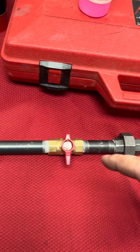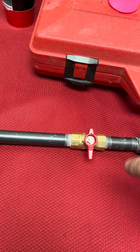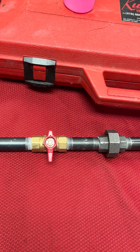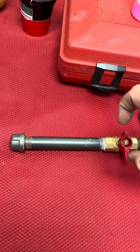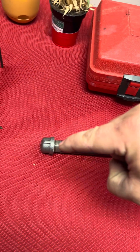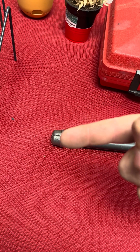You're going to have one of these to try it on. Right here we've got a ball valve. That ball valve remains closed while the rest of the system prior to it is pressurized. When you open it, open it slowly. The air will come in here and seep out this cap, which is intentionally leaking — yours will be as well.